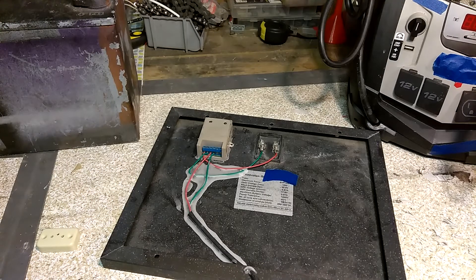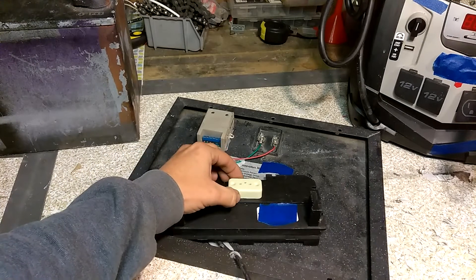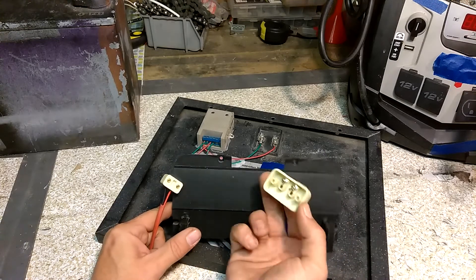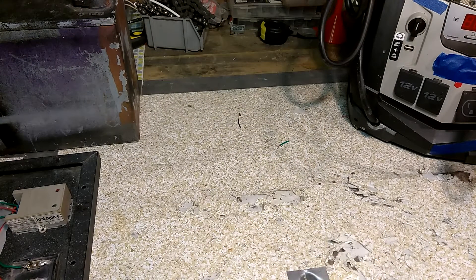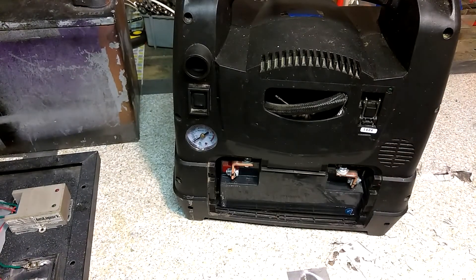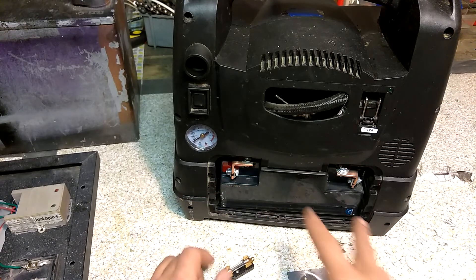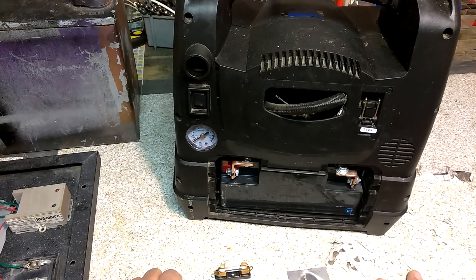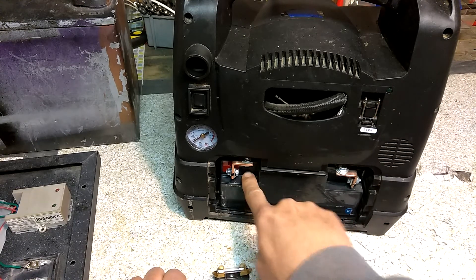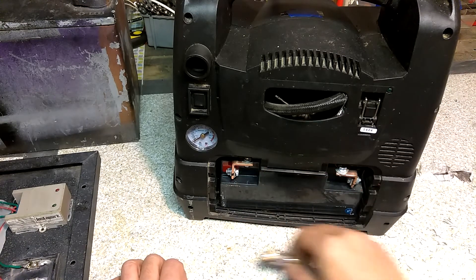So let's find the back plate here — this is the back plate that goes on to the back of the power setup. If we just mount that right there, then after we get it mounted, we run wires from these two screws — the positive wire to the positive and the negative to the negative. Another thing I'll be installing is a fuse. I'm using an old glass-style fuse with a 2-amp rating. The solar panel only pulls maybe three quarters of an amp at its best, so just to make sure if wires get crossed we don't have a fire. This fuse will essentially kill the whole solar charging setup if there's any short circuit or problems.